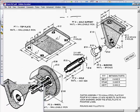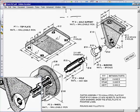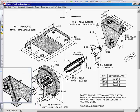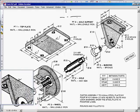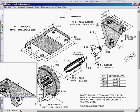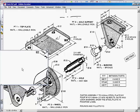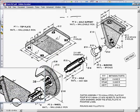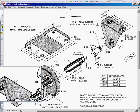Straight edges show up wherever there's been a machined surface. There's a machined surface at the end of that boss, so that top edge is not going to be filleted. There's machined surfaces where the hole goes through and where the spot face is, so those are going to be sharp edges. And although you can't see the top part in any of these views, the top of this had to have been machined as well because it has to fit up in here, and you wouldn't put cast iron up against a surface that's been machined. So that edge right there is going to be a sharp edge.